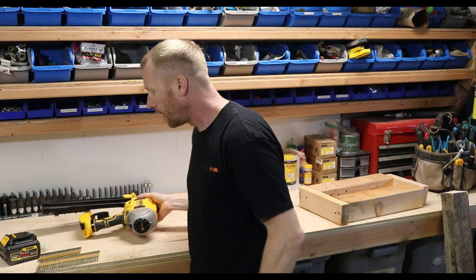Way back when, in the 90s, when I first started in construction, Paslode had their Impulse nailer, which is basically like a propane butane compressed gas cartridge with almost like a Makita 9.6 volt or 7.2 volt, I forget what it was, stick type battery. So it was basically an electrically ignited single cylinder engine. So I remember we kind of joked about them.